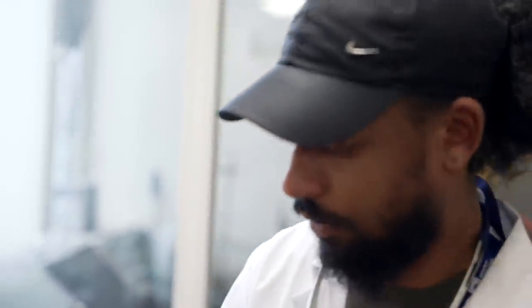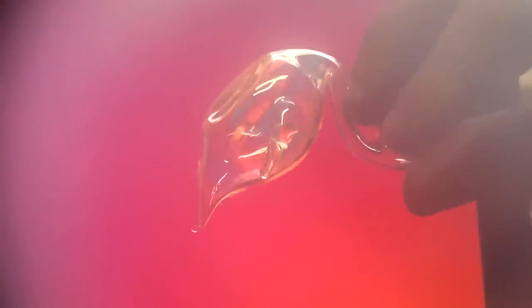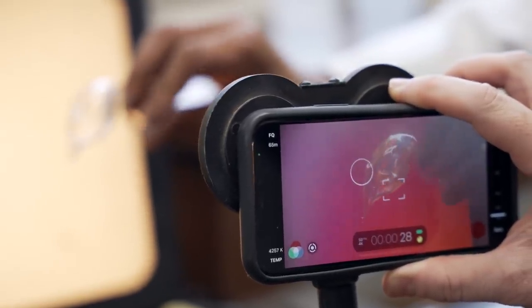So if you look through this lens, you can see a lot of blues, purples, yellows. Yeah. Quite a spectrum, to be honest. Yeah, look at that. There's quite a few colours, even from the head. Oh, look at that, right next to the wing. So those are stress points? That's just all stress. So once it's been in the oven and annealed, all that should just look as clear as it does when you're not looking at it on this. A lot of stress. It's a stress swan.